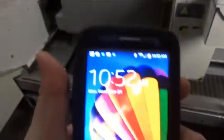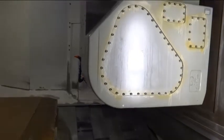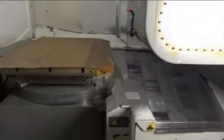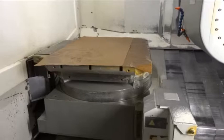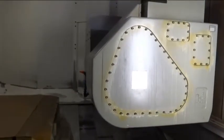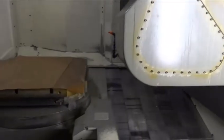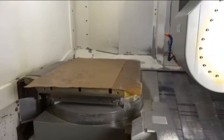Monday, November 24th. Again, we're just going to show the machine running here again. We will park the machine like that: the Y-axis almost to the left, and the X-axis about right here, and we go in this direction and touch the hair off the limit switch, and we park it right here for you guys. That's how DMC parked it for us also in Canada when we shipped it to us. So this is about equal to when the machine gets shipped.